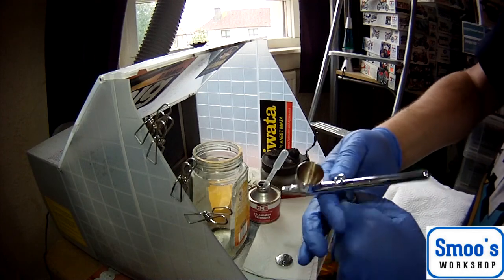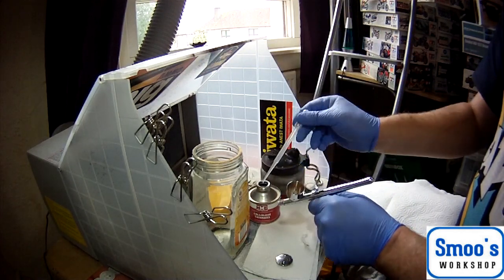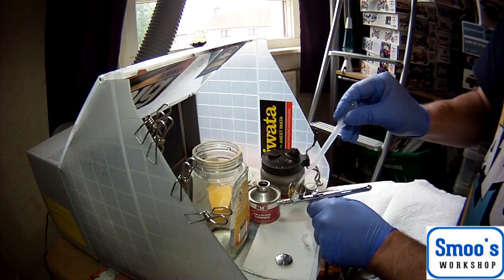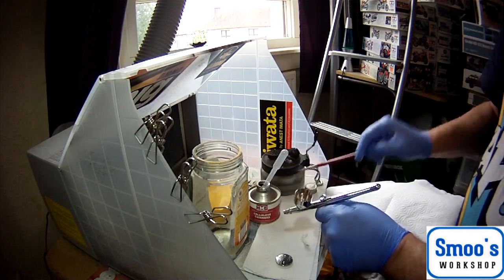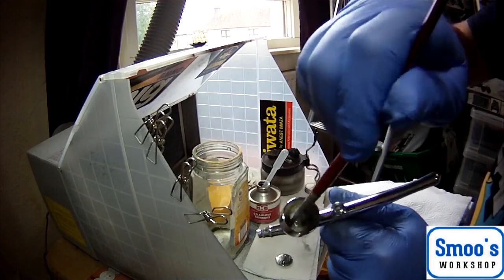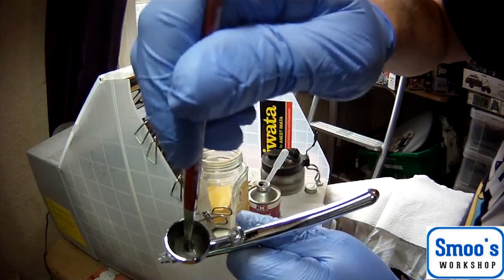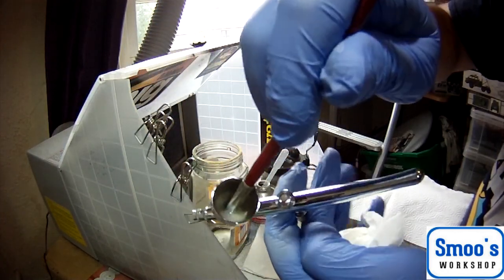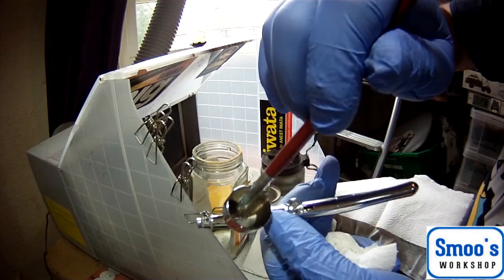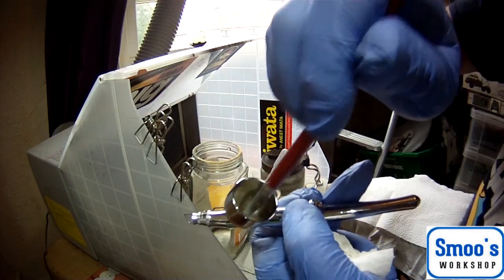Okay, that's not going to get everything out, although cellulose thinners tends to be an easier clean up, I find, because it's hotter than using the alcohol based ones. You sometimes have to get a few bits of work about, but we can see in there that the cup's clean, hopefully. We're getting that on camera. The cup's clean. What I'm just going to do is tip this back a bit and tip my needle back and get my soft brush in there, just to get in at the needle.